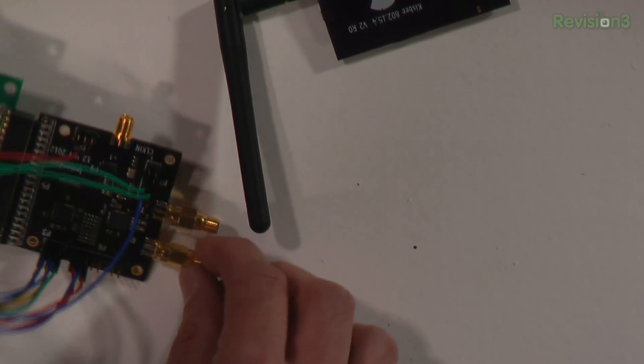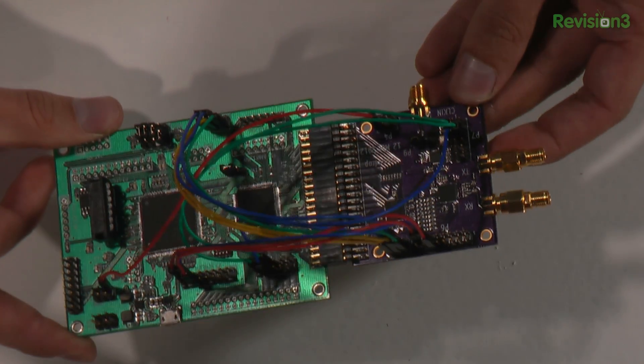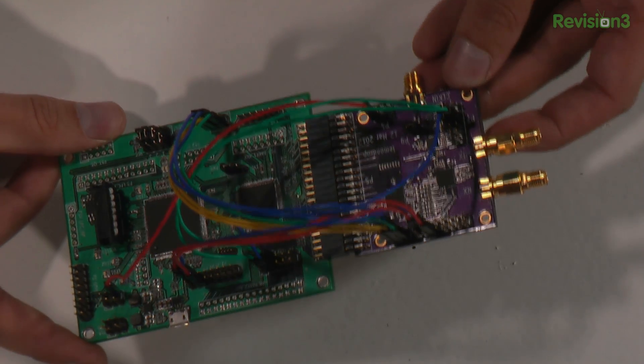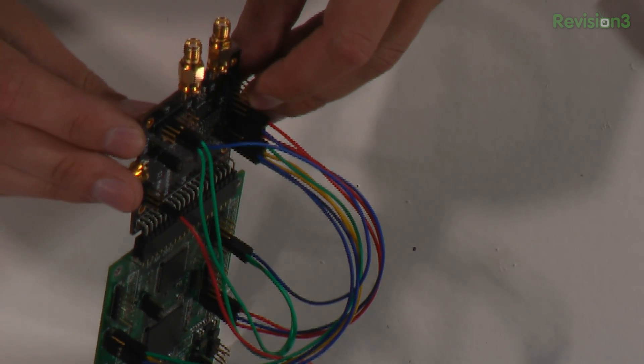This is my obsession lately and what I'm spending most of this year on. It's a project called HackRF and it is a software radio peripheral. The technique of software radio or software defined radio is digitizing radio waveforms — or taking a digital waveform and turning it into an analog waveform and spitting it out over an antenna. It's kind of like a sound card — a DAC and an ADC. It's a peripheral for a general purpose computer, your laptop or whatever. The OpenBTS guys are using the USRP — the Universal Software Radio Peripheral. It's a great tool.